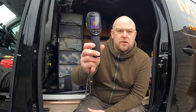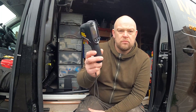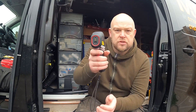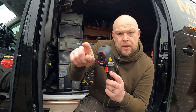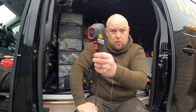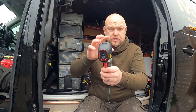Pretty good camera — fully charged, lasts for eight hours, picks up anything from minus 20 up to 550 degrees, and these are accurate to two percent, so you know exactly where you're at. Also, when you're using it, if you pull the trigger it'll give you a laser — so say you want to get the temperature of the top of a rad, you pull the trigger, you get a little crosshair on the screen, and on the actual rad itself there'll be a little red laser dot — that's the exact point it's taking the temperature from.